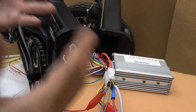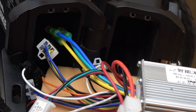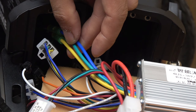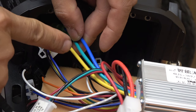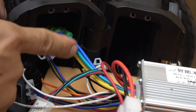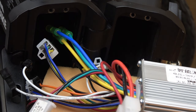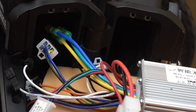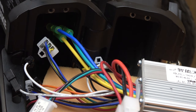I'll talk about that in detail in my next video where I'm trying to upgrade with a new controller on this e-bike. The three-phase power cable goes to your brushless DC motor and always has three wires: blue, green, and yellow. All you have to do is match up the colors from the controller to your motor wires and you're good to go. Sometimes even when you match these three colors, the motor still spins backwards. So all you have to do is switch out two colors — green and yellow — and it will spin forward again.